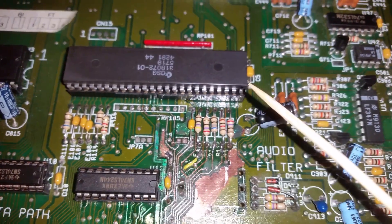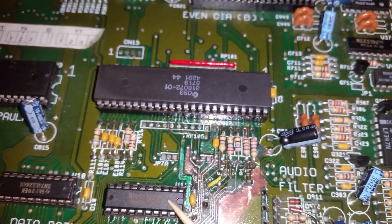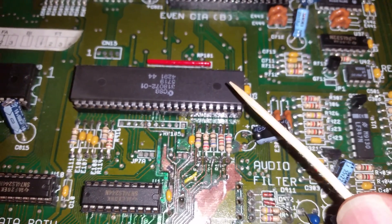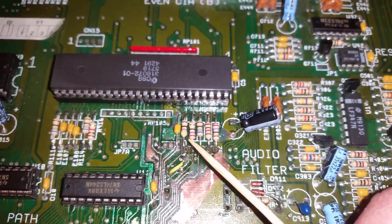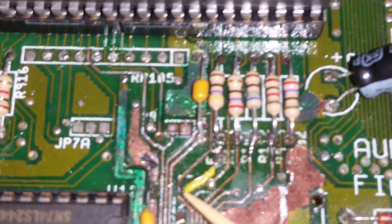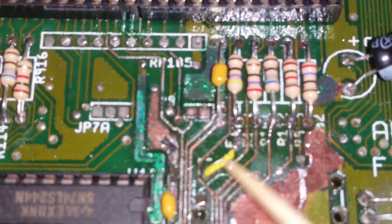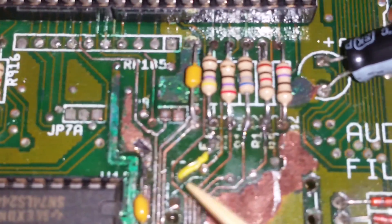I started with the damaged ones because it's a nightmare otherwise - really simple ones going from here to these bits. Pin 4 on Gary goes to the first pin on U12, which is the memory - the data goes through these chips. I couldn't get continuity and it wouldn't go from here to here. I followed it along and basically where that trace disappears, it actually goes through the board. At the other end it's supposed to bridge onto the first pin, and obviously the battery leaked, sat in that hole, eating it to death.